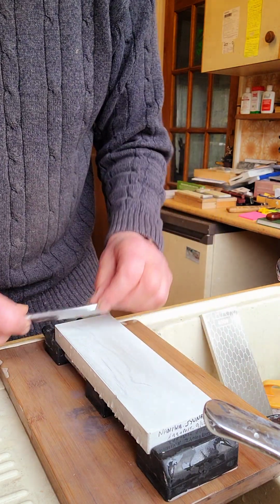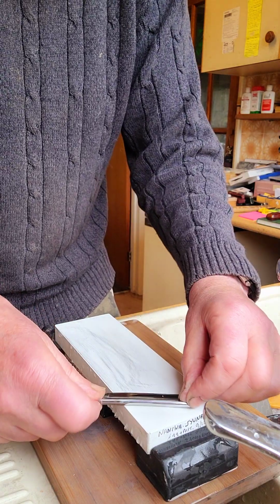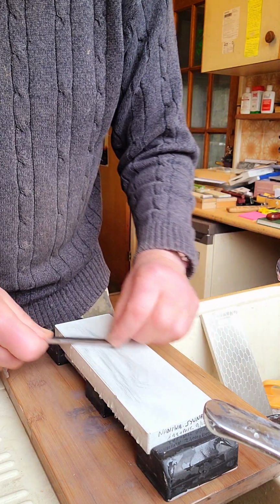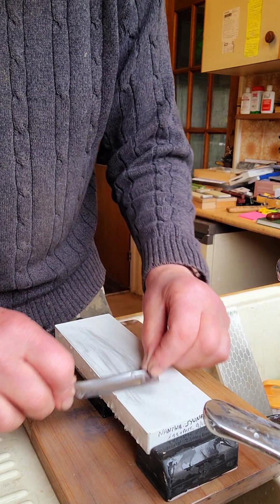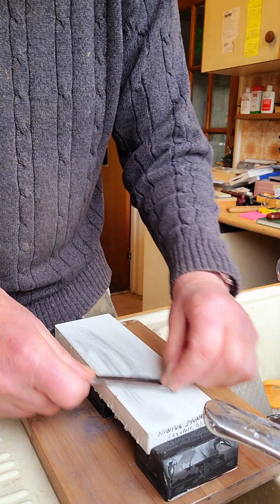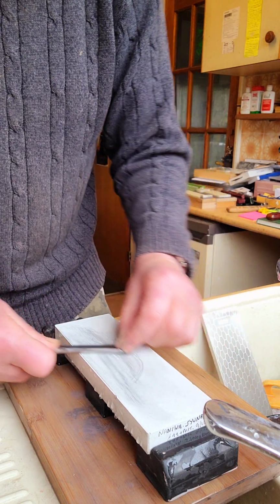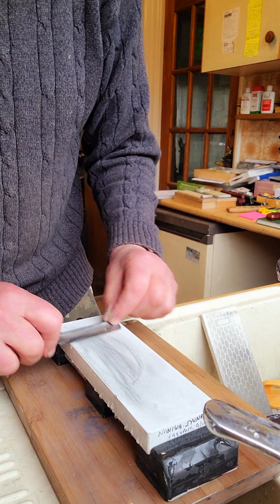So let's go and do this Puma. Totally different feel, by the way, on steel. The Puma steel, I would say, was actually harder. I can feel, even though I know it's not taped, but I can feel it. The Sheffield, very kind, quite a soft steel. Well, soft is a relative term. It's still very hard, high temper steel. Nice amount of swarf now showing on the 8K stone. I've got to be super careful with this Puma. I'm still favouring it towards the toe, just to make absolutely certain that that area of corrosion on the toe is gone. Right, that must be enough.